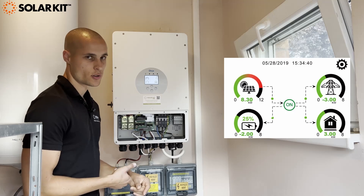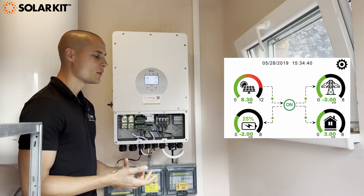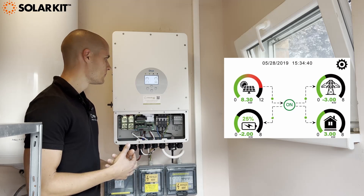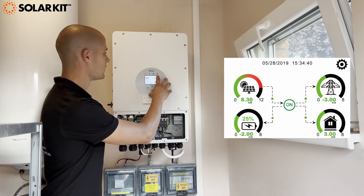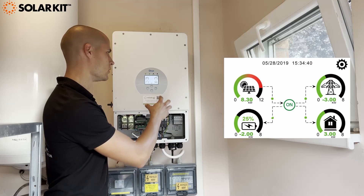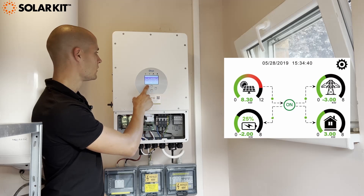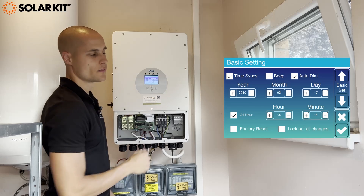The first thing you should turn off is the beeping sound that you will hear shortly, because once you power on the inverter it will automatically want to have batteries on itself and for this reason it's going to start beeping because it doesn't have a battery at default. To turn it off you can go to the upper right corner in the gear icon, basic settings, and the beep should be turned off like this.